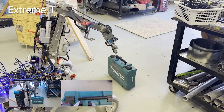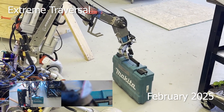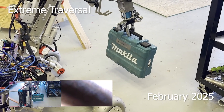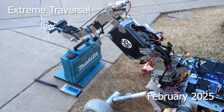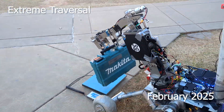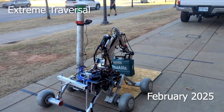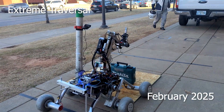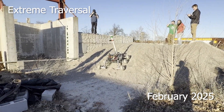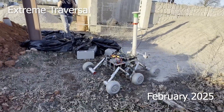The manipulation subsystem consists of an arm made from three aluminum members: the bicep, forearm, and wrist. This ensures high levels of stability and precision without sacrificing power to rotate the arm and payload. The bicep and forearm are connected by joints driven by electromechanical linear actuators, which allow for precise movement. With the addition of forearm hooks, the arm can easily lift objects weighing over five kilograms. The claw utilizes an ACME screw to drive a pinch mechanism that can grasp objects up to 14 centimeters in diameter and is mounted on a slip ring assembly that allows continuous 360-degree rotation.